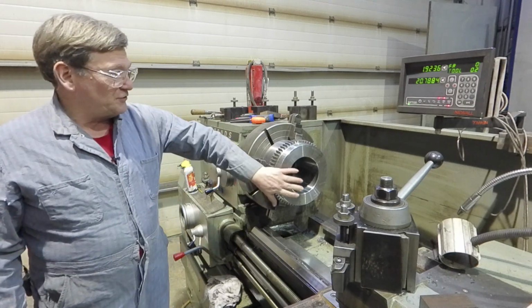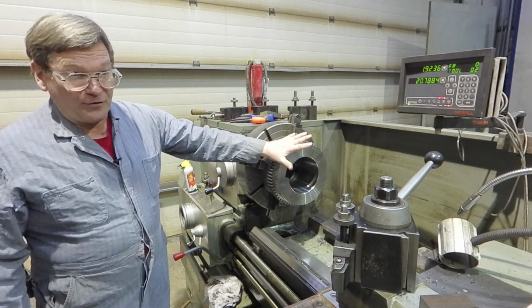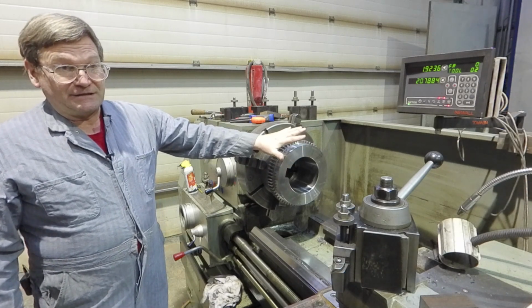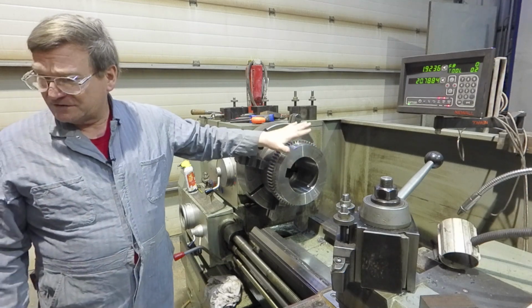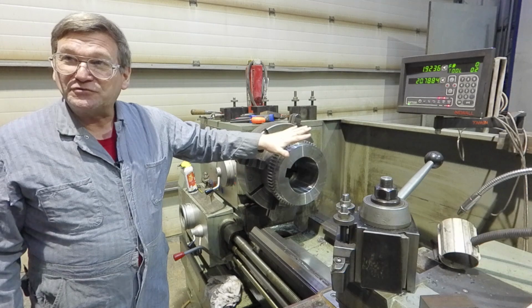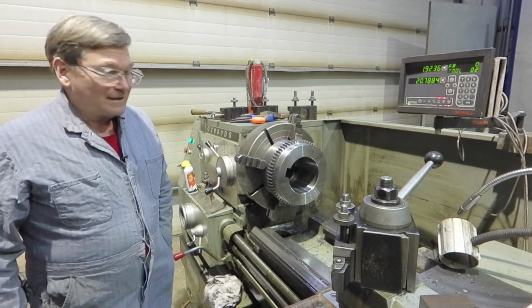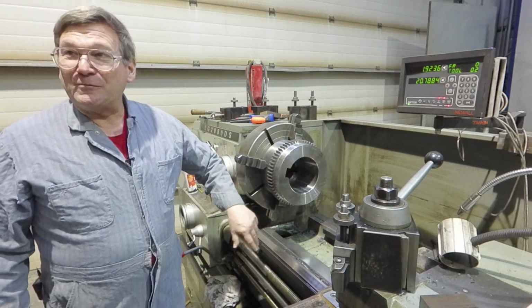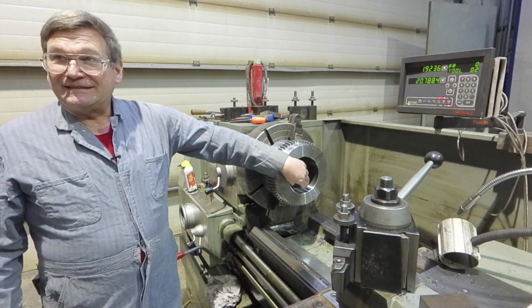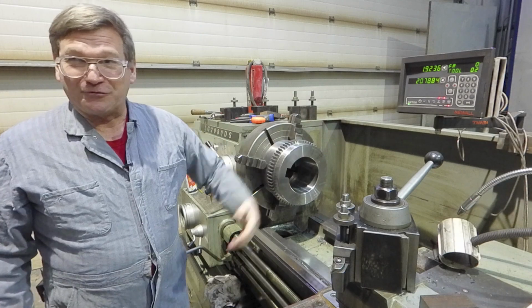So we're essentially using this as a setting gauge, because we all agree right now on this number. The last digit is 2; I forget what the rest of it is, it's written down somewhere. We're going from 2 thousandths to 6 thousandths on the bore size. Since we're not doing a full measurement, we'll set the dial gauge in here on 2 thousandths, and we'll be looking for 6 as our answer.